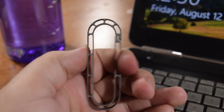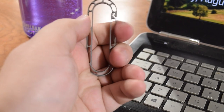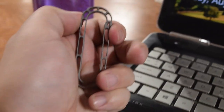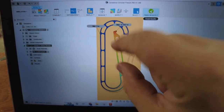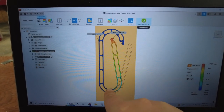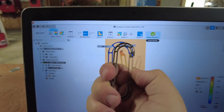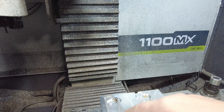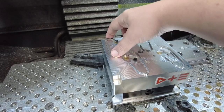The opening and closing action is pretty good. There's no click as it opens and closes. It's not as stiff as I would like it, so I may add some more webbing somewhere just to make it a little bit stiffer, but it does work — I am happy with the function. This is the new design running through Fusion FEA. I added an extra little webbing here and kind of moved them apart. That should lock this arm together as one solid piece and makes the spring effectively shorter, which should make it a much stiffer opening mechanism, back to kind of like where we originally were, because this new one is much lighter to open. I'm going to do this with just that one screw holding down the part and no clamping force.